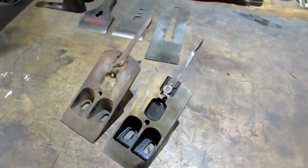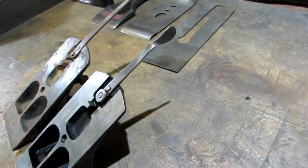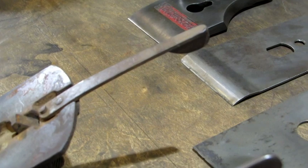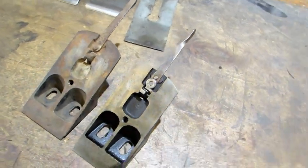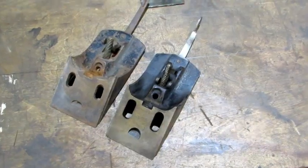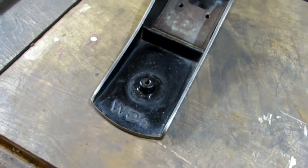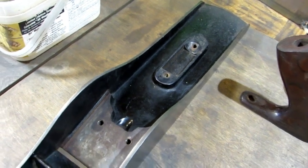The one on the right is for the Winchester, and the big difference is the lateral adjustment lever. That lateral adjustment lever on the Winchester is identical to the laterals that were used on the Union planes, whereas the typical Stanley lateral — that's what you see in all the Stanley bench planes — looks quite different. So that's a big difference. But other than that, exact same angles, construction is almost exactly the same. The bottoms of the 605½ and the Winchester 5½ are exactly the same except for the numbers, and they don't have the patent date that you'd have on the Bedrock planes — but other than that, they're pretty much identical.